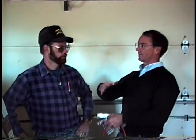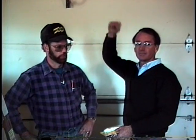So you've got to be careful, because they use a special 24-inch bar that you've got to use to tighten that spring. Take that torque off. If you don't, you can get in trouble. It'll break an arm or crack a jaw. Yes. You have to be careful with the torsion springs.